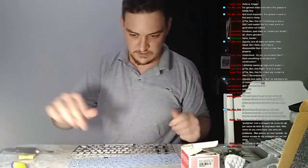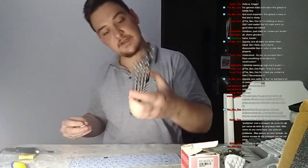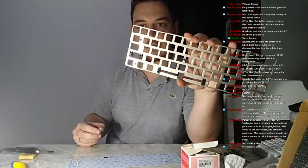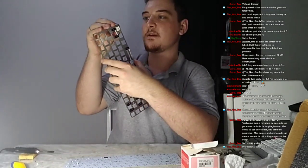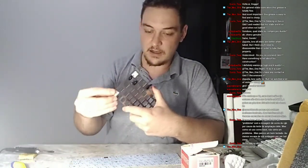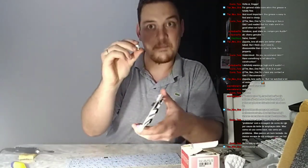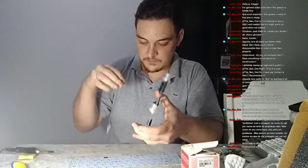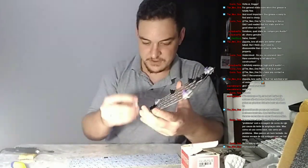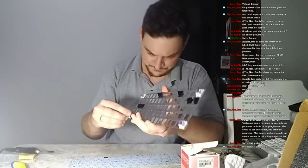Awesome. Okay, so the first thing that we could do is to fix the PCB on the plate. I generally solder the four corners first, just to make sure everything is aligned and we don't have issues. Always make sure that the pins are not bent, because if they are, they won't go through the holes on the PCB and you'll have a hard time getting it out. So always make sure that those pins are not bent.